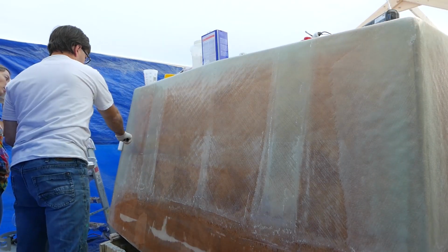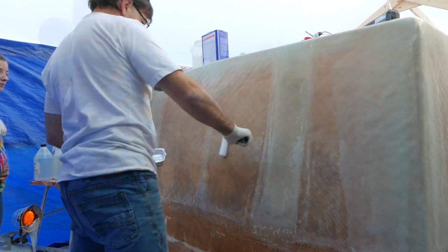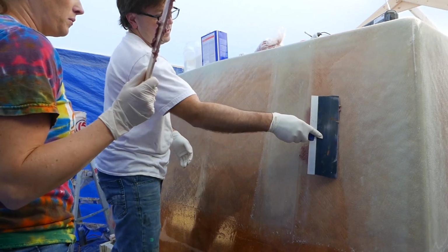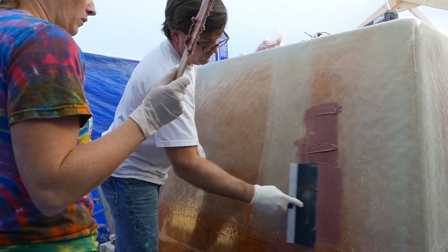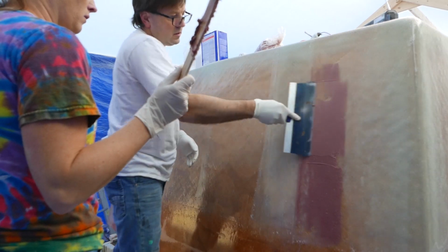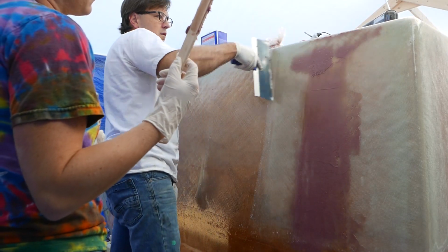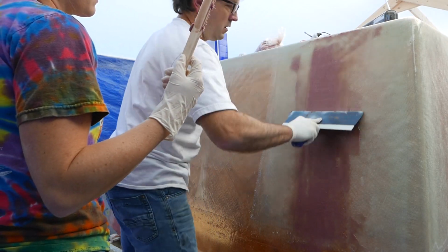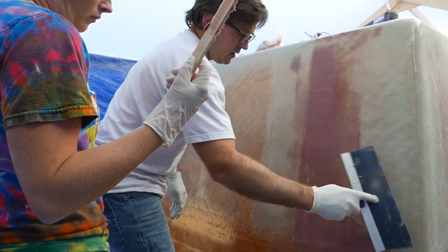With so many overlapping layers, there is a lot of sanding and fairing work involved to restore the surfaces to the desired flatness and smoothness. To create a fairing compound, we mixed epoxy with fumed silica and phenolic microballoons. The latter additive makes for an airier consistency that is easier to sand, and also gives it a dark color that makes it much easier to see high and low spots in the fiberglass.